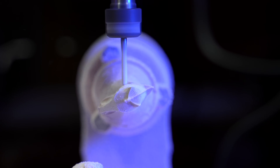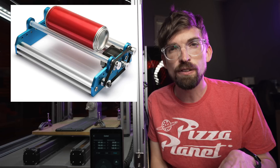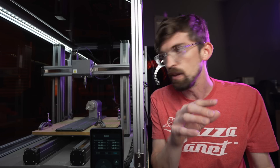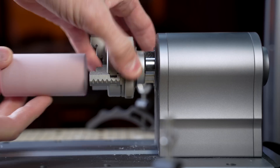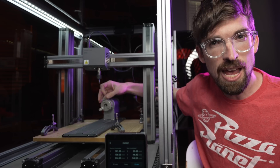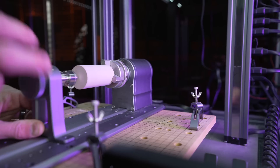The ability to do rotary really opens up a bunch of different options that you just couldn't do before. This thing is going to get a lot of nerdy use — I'm going to make wizard wands and lightsabers with it. Laser rotaries use two rollers that your piece just sits on and rolls over, but that definitely wouldn't work here because once you apply any carving force, nothing holds it to the rollers other than gravity. This rotary is much more like a lathe: it has three jaws that clamp down into your material and a tailstock that pushes in and supports it from the other side.